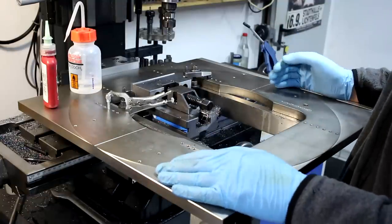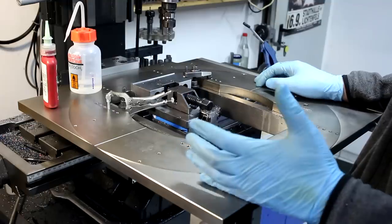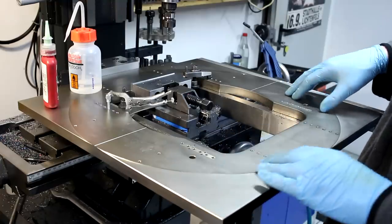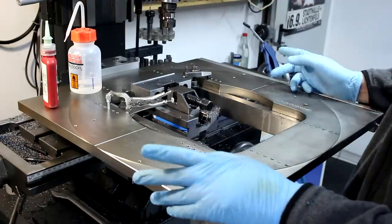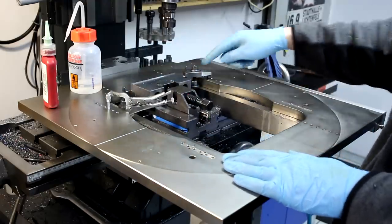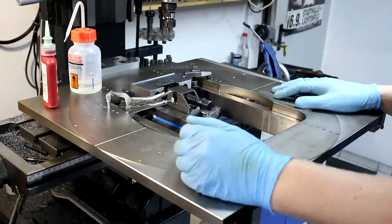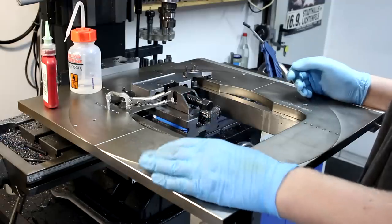This is a relatively uncommon job for me. This is a large subplate for a PCB test machine test jig. This plate is D2 tool steel actually, which is machined and ground — relatively nicely made. But the test specimens get bolted down with M5 screws in those four locations, and over the past 12 years or so those threads had worn out and stripped completely.